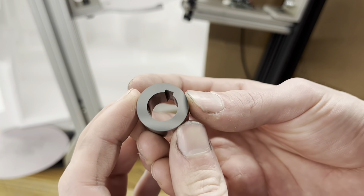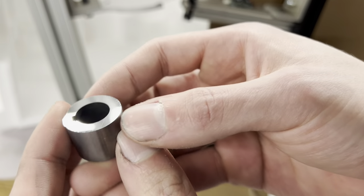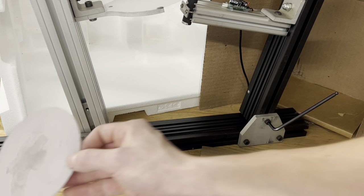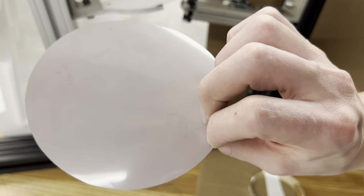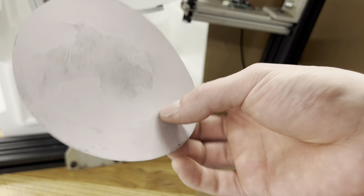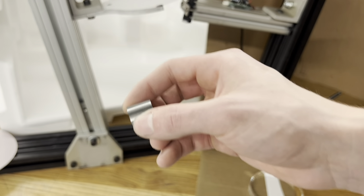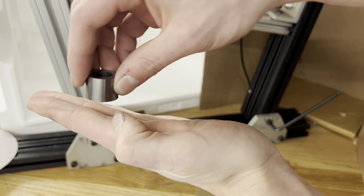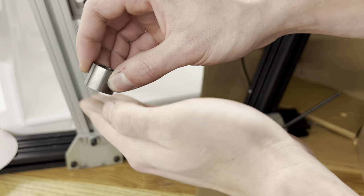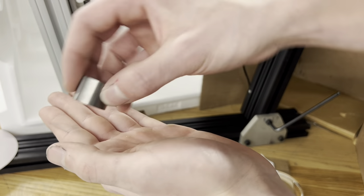This first side here is the shiniest side — that's pretty darn close to a mirror there. But this was not done on those lapping plates. This was done with some one micron lapping film from McMaster, thin plastic-based diamond lapping film — put this on a surface plate and lapped it on there for a while. And this looks nice, but it isn't actually very flat because you have a big compliant layer in between the part and the plate. This tends to rock and get the edges quite rounded off. Even with good form, it's far more difficult to get things flat with a big squishy lapping plate.